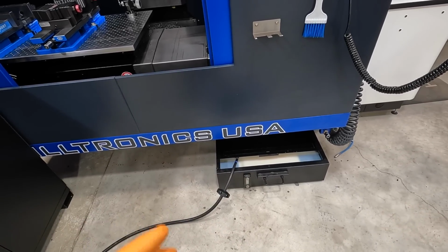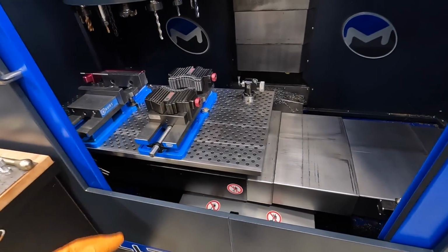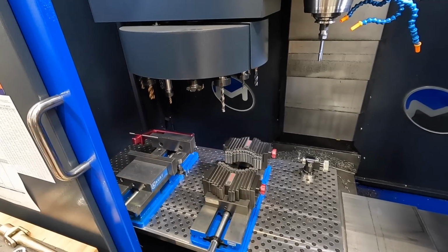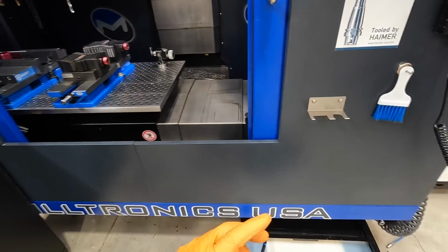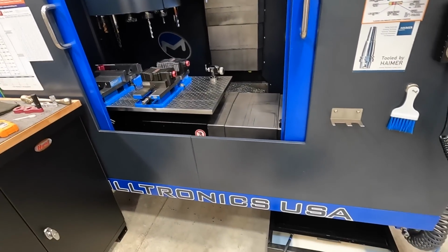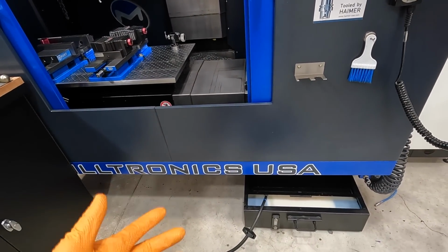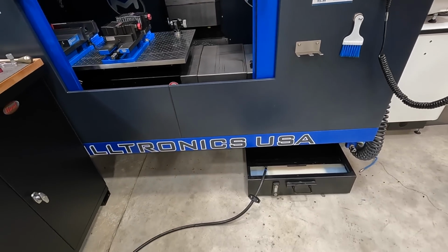The important thing is that you have enough soluble oil in there to prevent any kind of rusting on the machines or your tools, vices, and also to give proper lubrication to the cutting tools when they're working as well. Too little soluble oil in there, and then you're going to have rusting issues and that kind of stuff. So I think a little bit heavier is going to be okay, but you don't want to go too heavy because then you're just wasting it and using up more than you should. But I'm going to leave it right there.